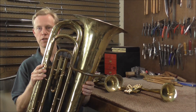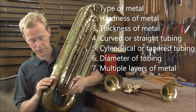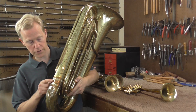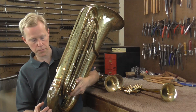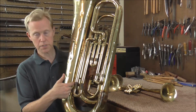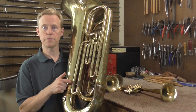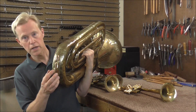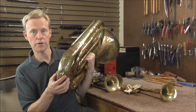While I have this tuba, there's another question: are there multiple layers of metal where the dent is? You see this very often on tubas. Where this ferrule is, this is often dented in, so this dent is going to be a lot harder to get out with the ferrule over the other tubing. There are two layers of metal here that you need to contend with, and you'll probably need to take this apart to get this dent out. Also, you can get a dent underneath the brace — on tubas the braces are often pushed into the tubing, so you may need to unsolder the brace, get the dent out, and solder it back on. Another common issue on tubas is getting dents underneath the bow guard; you'll need to pull the bow guard off, get the dent out of the tubing and the bow guard, and then solder it back on.